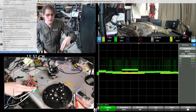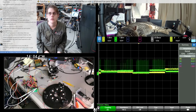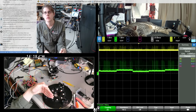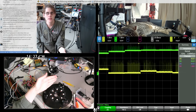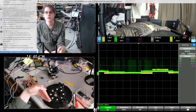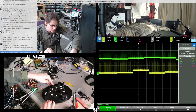Is that working? So now it's this one, and that one. That's still got some interference, huh? I could try powering one of these off of a function generator. It might just be I can filter out the noise and still use them for obstacle detection. I mean, this is definitely usable with every other turned on. Let's try plugging the one in between those two and see if that still seems usable.